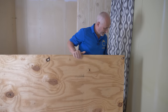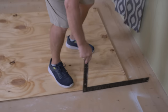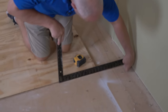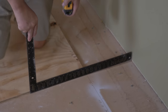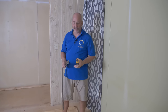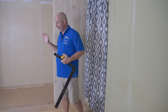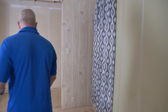Here's why: as I get to the outside you can see that gap — my finger goes underneath it about 10 inches. So I'm going to square off, cut pieces to fill, keep my life simple, and install this over top of the existing subfloor. In other areas we've got weak spots, holes, and inconsistencies, so trying to remove all the subfloor makes no sense.